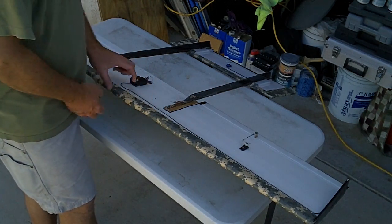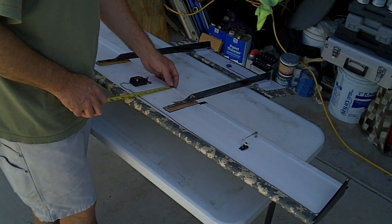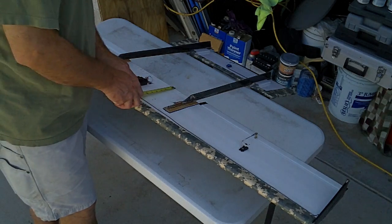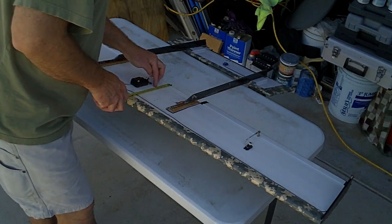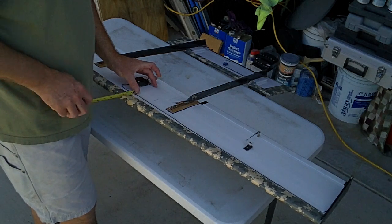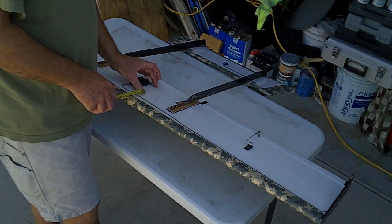There's the main spar, which is on the 1/3 position. So if you take 9, divide that by 3, that's 3 inches in. So at 6 inches in, and then this back dowel is at 3 inches as well. So I divided this into thirds. 3 inches from the leading edge, roughly, is a spar.